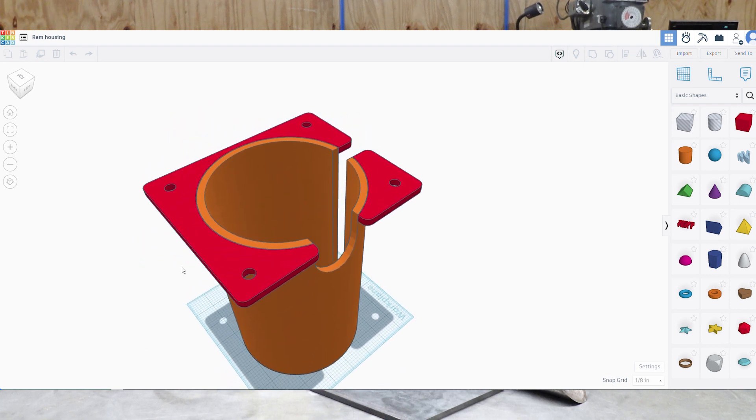On the top you see the mounting plate, which is two pieces with the cylinder inside. That cylinder is going to be welded to the mounting plate. When we cut the plate out on the plasma machine, we're going to leave metal between these areas — bridge these gaps — and that's going to do two things: keep these pieces oriented in their correct locations when we weld them, and also make this a single piece in case we need to machine that cylinder out a little bit. Plasma does cut a bevel, so we might need to straighten that out, and the tabs will keep everything in place if we need to machine this out.